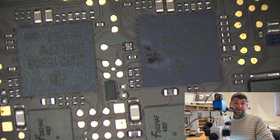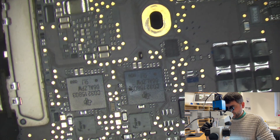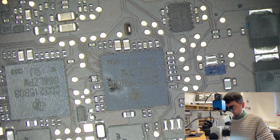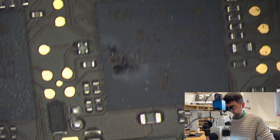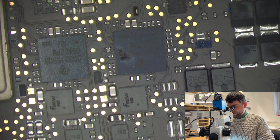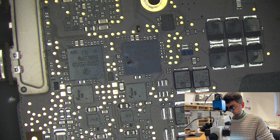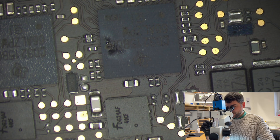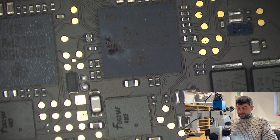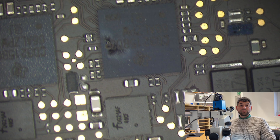This is the reason why it's not starting up. It's a common problem. I'm not going to measure anything else — I'm gonna take off this chip and place a new one in and test. There's no point doing anything else right now because I can see straight away there is a cooked component which needs to be taken out of the board and a new one placed in.